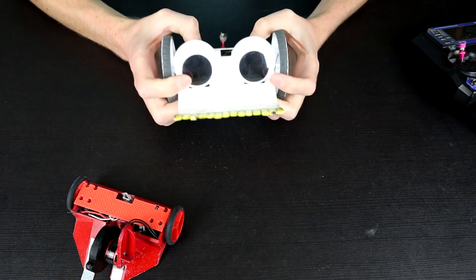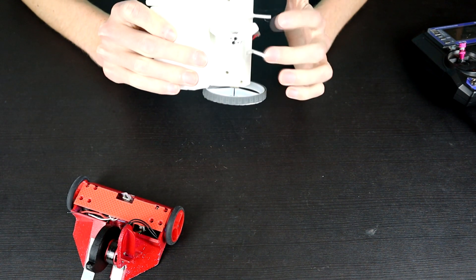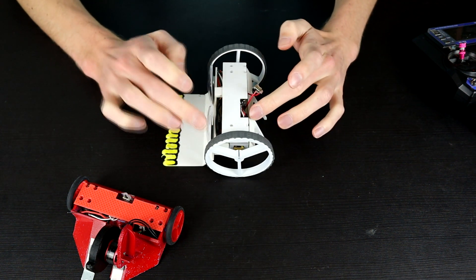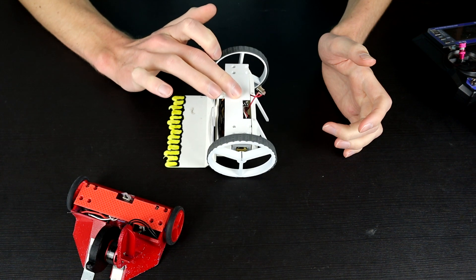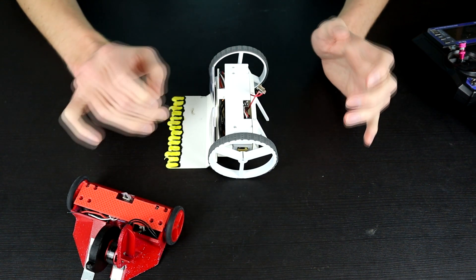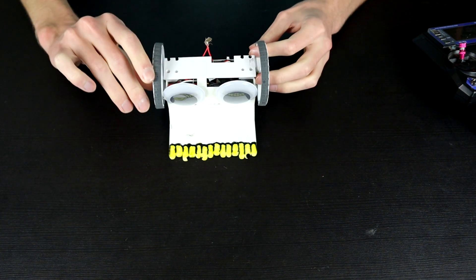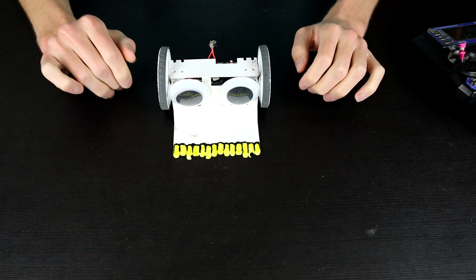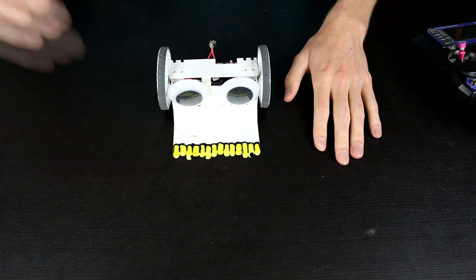And there we have it — I'm quite happy with how Spooky Mark II has come out. The fan seems to be doing some kind of job. I think the stabilizer bars are just a little bit too long so I'll probably file those down a little bit before the event to get them further up off the ground, because they seem to be breaking traction a little bit. These motors are also kind of wobbly — the whole robot wobbles back and forth — so I might try and update these N20s because the gearboxes are quite loose, which makes it hard to charge at people, and that's the whole point of Spooky Mark II. I've only got about a week left before the event but we're getting into a pretty good position. I hope you guys enjoyed that one and I'll see you in the next video.